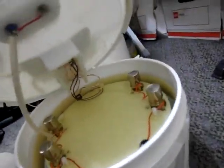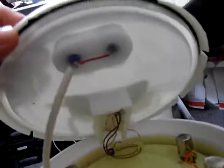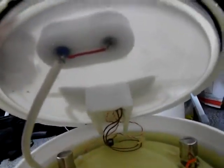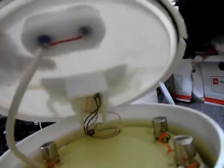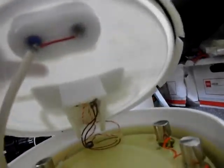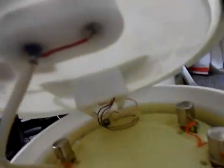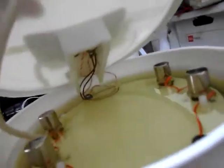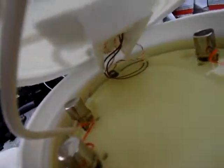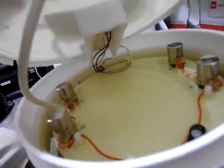Inside the transformer there is a small plastic box which insulates the AC input lines. This is sealed with some silicone caulk to the top of the bucket for insulation, and the edges of the box dip down beneath the surface of the mineral oil, which prevents any arcing between the tops of the rectifier diodes and the AC input lines. It's important to ensure that the mineral oil level is always above the bottom of the box, and standard mineral oil may be added if necessary.